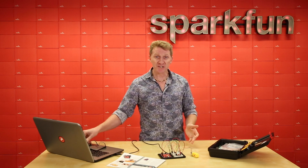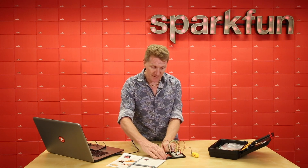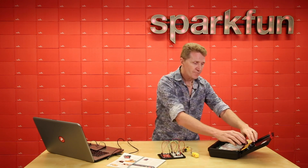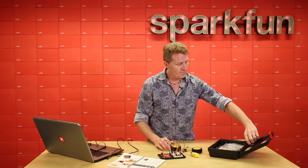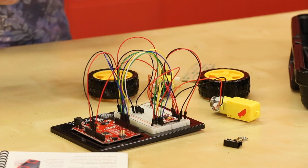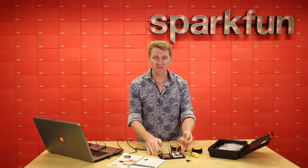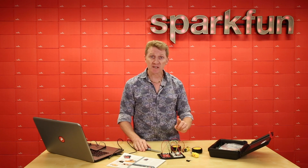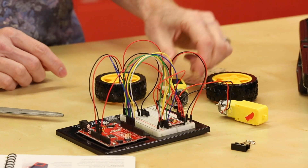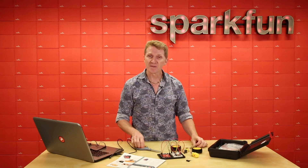For this next circuit, we won't be doing much changing to the circuit itself, but we will want to construct our bot. As always, when adding to a circuit, we do want to power down — make sure you're powered down. What we'll need is our second motor, a pair of wheels, our binder clip, and our dual lock, and of course a pair of scissors. We're going to cut the dual lock and apply it to both motors and then two pieces to the underside of our base plate, giving us the base for our robot. One thing to be careful of: on one motor, put the dual lock on the side with the sticker; on the other motor, put it on the opposite side. That way your motors will mount properly to drive your robot forward.